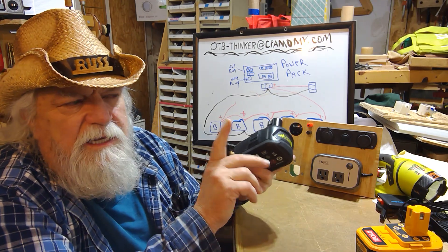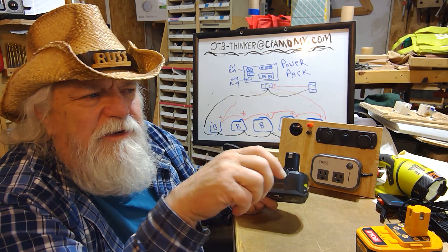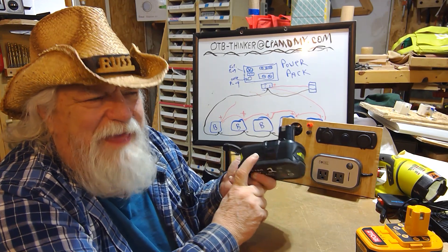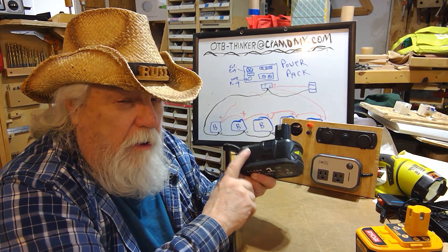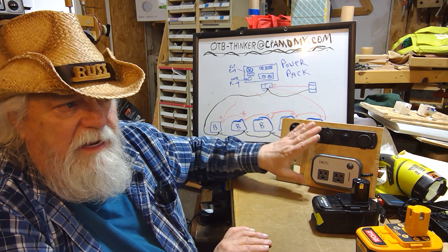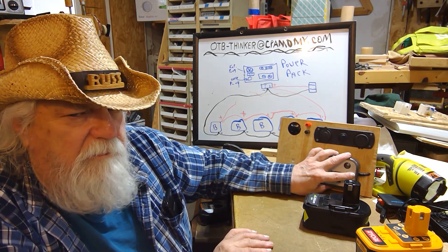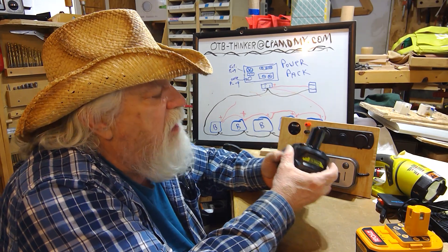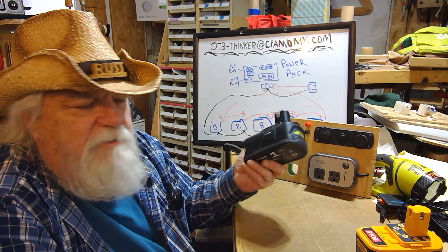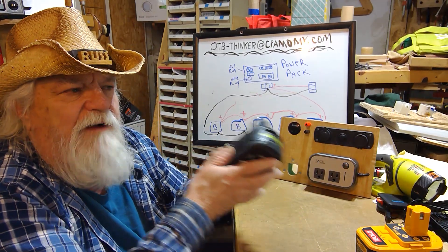Probably every time it trips it weakens the sensor a bit, so you want to be careful about repeatedly overheating it. Near as I can tell, a Ryobi chainsaw draws about 4 amps — though I couldn't tie that down exactly. I think 4 amps is the maximum and staying under 3 amps is better. That gives me an idea of the limitations, but I believe I can draw all the way up to the 200-watt rating without overheating. The battery does seem to have its own BMS, though there are some things I'm not 100% sure about.